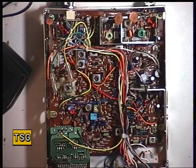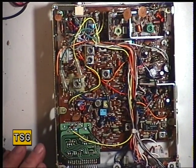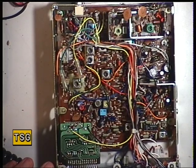Welcome back to the receive section of the York JCB 861CB radio from 1981 using the Cybernet 134 chassis. Having put the signal generator on and cleaned that volume control, that's nice again. We're greeted with it receiving nicely and it's 0.3 of a microvolt on the attenuator at the moment on the signal generator.